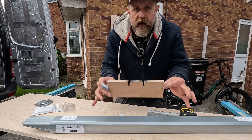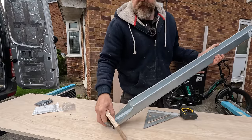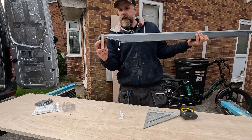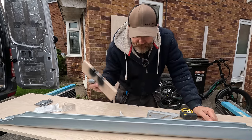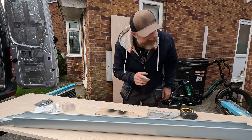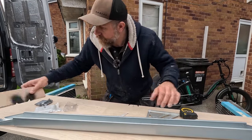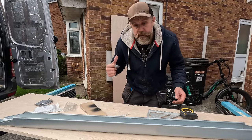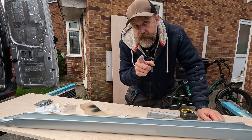What I made was this little template here, and it fits perfectly on the end of the support. You can imagine it's just going to sit on the wood — I don't need the metal clip plate at all. Because I made a template, I was able to measure my points along the piece of wood, pop that on there, spray it with a spray can and it's all ready for cutting. I'm going to have to adapt this template to fit the other end since it's just a little bit thinner.